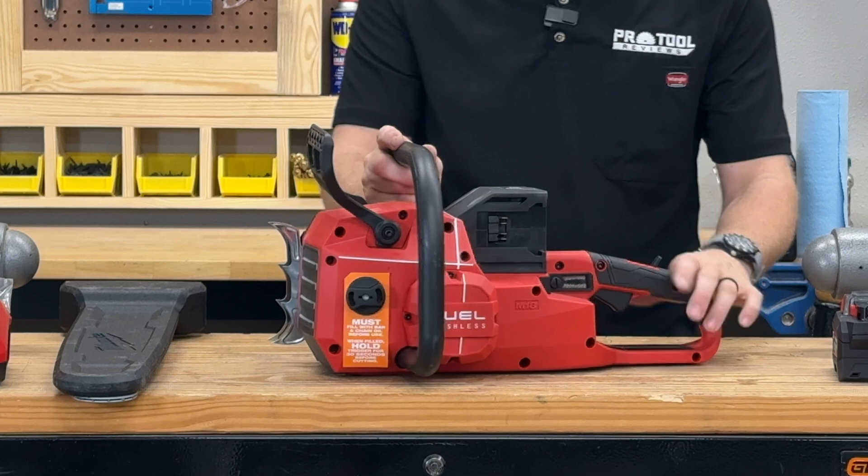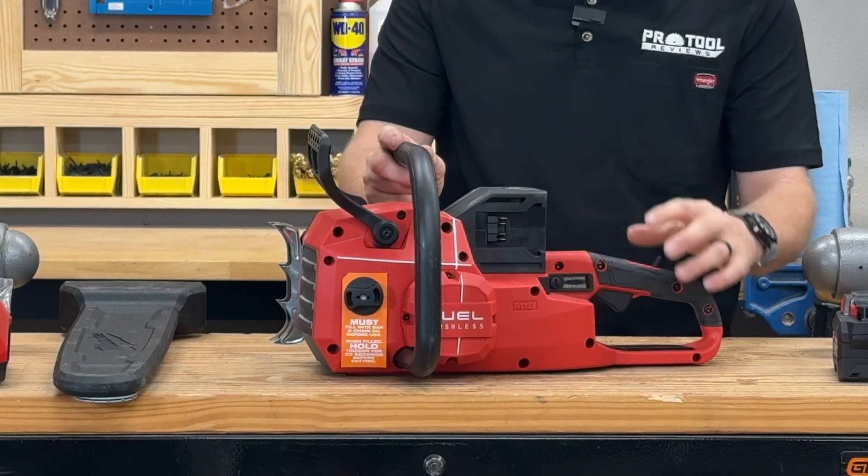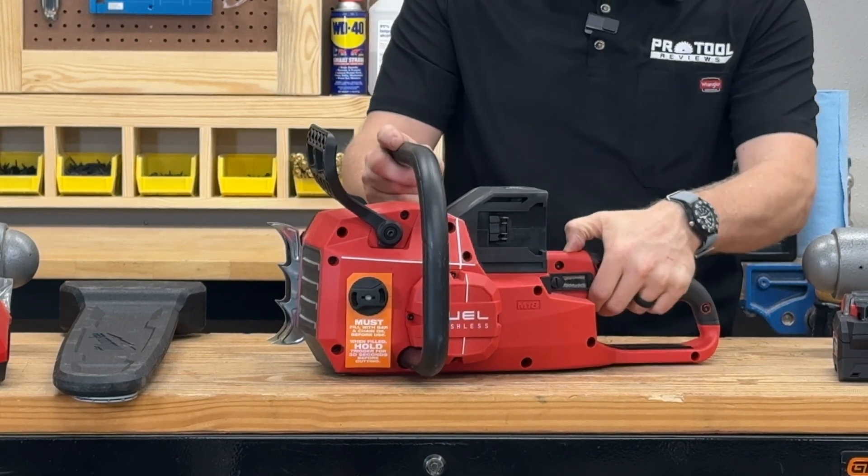The reason why that matters is this: if you get into cutting some tougher material, maybe harder wood, you're gonna switch it to the upper mode, the 5.8. What's gonna happen though is it's gonna demand more power from those batteries, so you're gonna consume your batteries faster and also heat up your saw a little bit more. Once you're done with that harder material, go back to your standard mode — you're gonna extend your run time and also run the tool cooler. That's just right at the tip of your finger, right here, and you'll be able to reach up and adjust that.